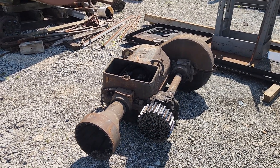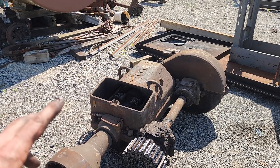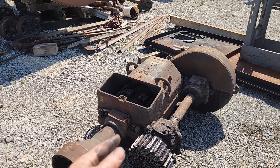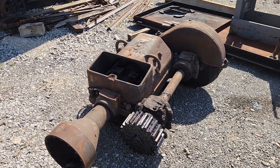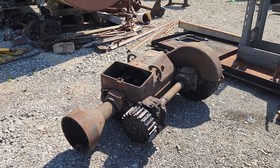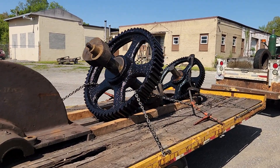That's another reason why I wanted a heavy gearbox — to have some sort of emergency braking ability. The other thing we can do is set up the motor with a dynamic brake so that as it winds down it's creating current. A DC motor will also work as a generator, making power to go to a set of resistor banks. The resistor banks create the resistance which slows the motor down — just like dynamic brakes in a diesel locomotive. We can do that with DC motors, so I want that safety device on there.